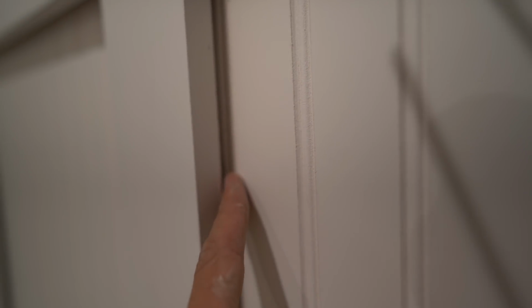So we got our stiles right here lined up in the corner, and we got a tight corner all the way down, and we should line up on the rails down here too. Good. Then we have our cap right here, 45 miter. I just threw my miter saw protractor in that corner. Told me 45. And then behind here, you can see that seam right there. That's where the two beadboards come together, and you'll never see it. And of course, none of this stuff is installed yet. Smooth here due to the pocket holes.